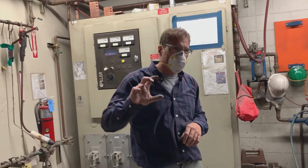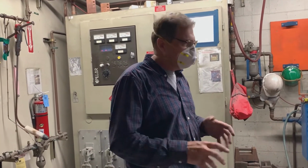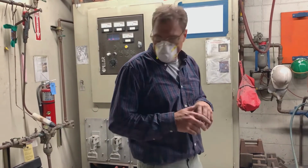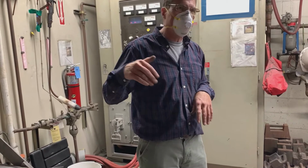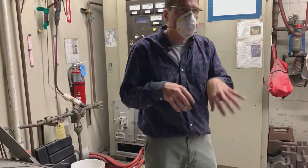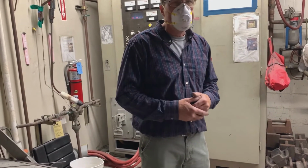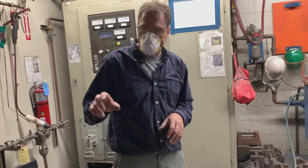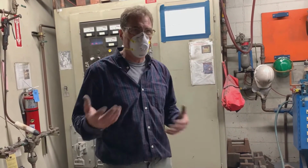What you want to do is just turn it on low to get the crucible warmed up a little bit, and then give it more power. So what we would do is carefully scrape out that little bit of skin on there when we're done pouring, and then get anything else out before we start pouring. The other thing we'll do is use a little bit of flux, and we'll go into that a little more once we get to the melting part of it.